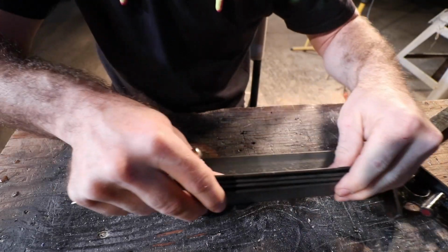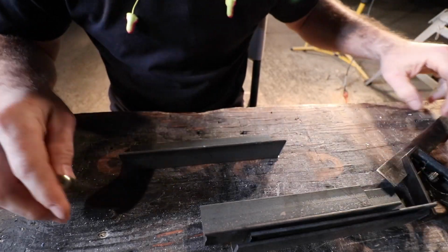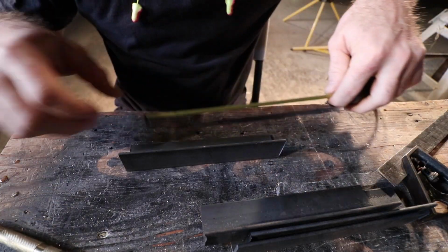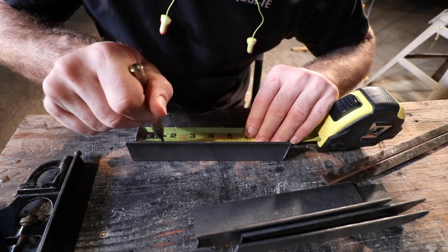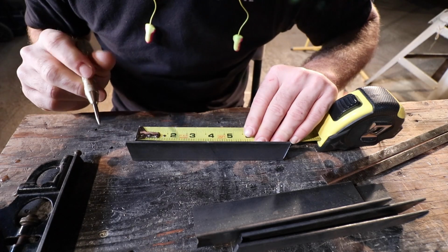We began by making the roof rack hardware by cutting the angle iron into short sections. Marking the holes with a spring-loaded center punch gave us a target for drilling the pilot holes.